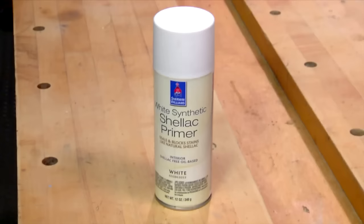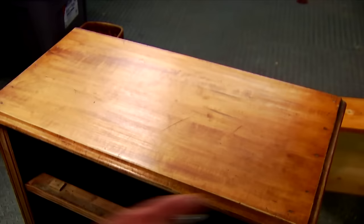So I'm going to test a section for possible silicone contamination. Well my suspicions are confirmed. These craters that are forming are caused by silicone that's penetrated into the existing finish and in spots is repelling the new finish I'm trying to apply. So where does silicone come from? The most likely source is spray or liquid furniture polishes. Repeated use over time builds up residue which becomes apparent during refinishing. Shellac has the ability to seal off silicone providing a barrier that isolates it from the new finish.